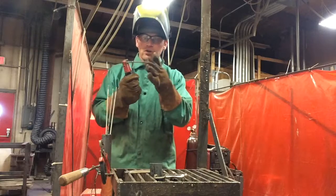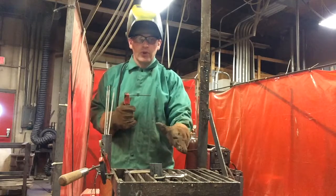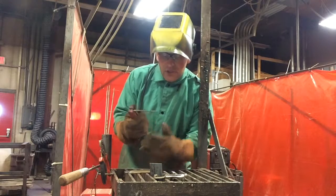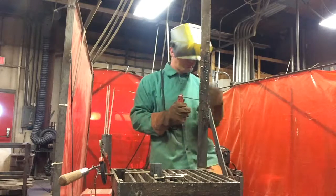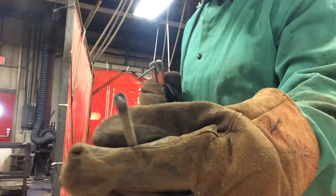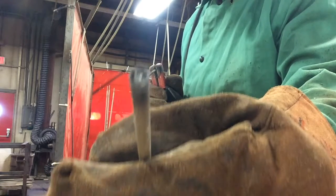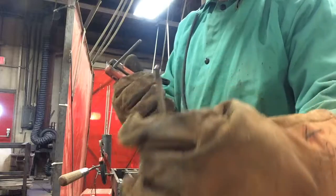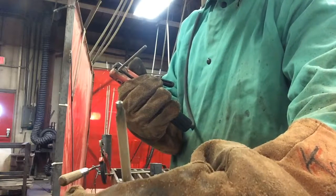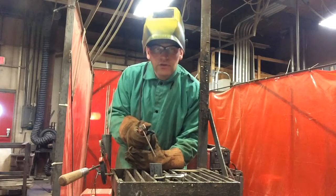So like I said, I use these small half-used electrodes, and that way I'm saving my full ones for an actual good weld. So when I tack this, I'm going to get down here nice and close. I'm going to pinch the end of this little electrode, because whenever you stop welding, the metal actually kind of goes inside a little bit. So it's a little concave shape where the metal is not the farthest thing out. So I just pinch those ends a little bit, and then that metal is the farthest thing out. It's what's going to strike an arc first, so I'm not having to brush that off when I'm doing the striking. I'm going to strike an arc on here and do a little weld, and that'll be a tack.